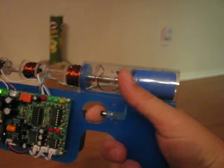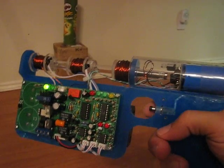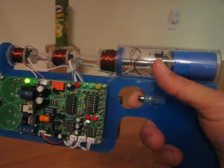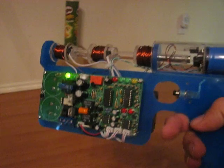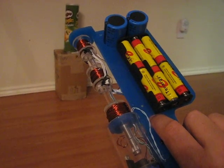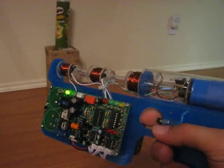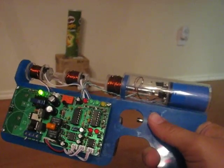There's a neat project I did with the EMAT controller board. I added a third stage. This is the first stage that was manually operated — push button here, momentary switch — fires the first stage, and then it uses the two optical gates that are on the controller board. So three stages total, quarter inch by one inch long, cold rolled steel projectile, uses six AAAs. Pretty neat little project, works pretty good. Shoots about 180 feet per second, so it's got some good velocity to it.